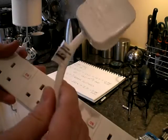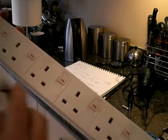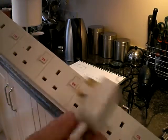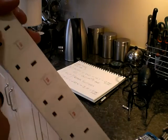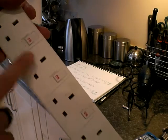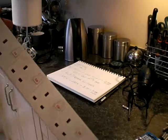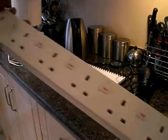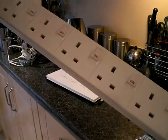So if I put a kettle and a toaster and a hair dryer, I'm straight over the amount — that's too much wattage. So be aware what you're putting into an extension. You can put some lamps, your Christmas lights — that's not going to go over your 13 amp. Add all the wattage together of each individual appliance you put through here. If you put a kettle at 3000 and a toaster at 2000, you're already over it — it's just going to blow, it's not going to work. Christmas lights at low wattage and you're probably going to be alright.